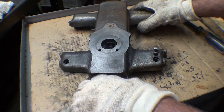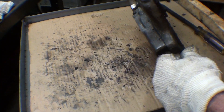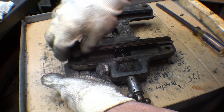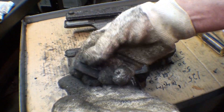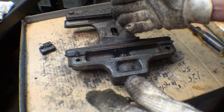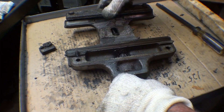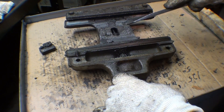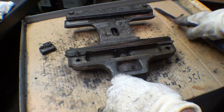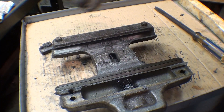You've seen me do that in a lot of other videos with different lathes. You can see the gib screws. And in flipping it over, this of course is the carriage lock. I finally gave up and put gloves on here because my hands just get so black within minutes. You can see we've got a lot of crud here — chips, dirt, grease, whatever. This is the gib I was talking about. I'm going to take that off right now.